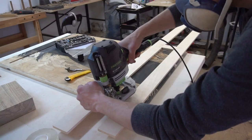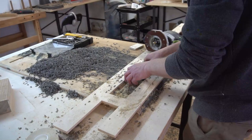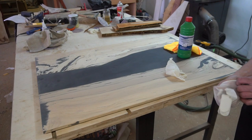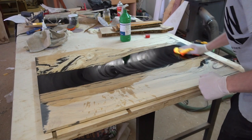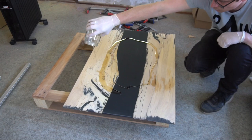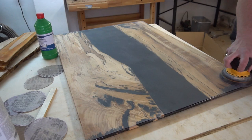Now hold up — what happened to the workshop? Watch my workshop vlog to find out more, link in the description. But here's the long story short: after all these failures I was just trying to forget about this project for a few months. I had other things to do like polishing up the workshop. But after gathering a bit more experience I finally felt confident to continue. Back then I already knew that spalted woods should be stabilized since the wood is so soft. So I cleaned the top with washing alcohol to remove dust and stabilized the whole slab with several layers of top pour clear epoxy. The very porous wood will absorb the resin and make the wood more stable and dense in the process.